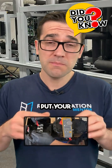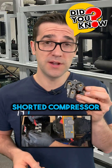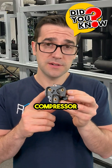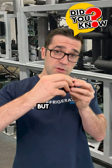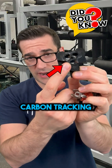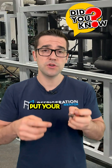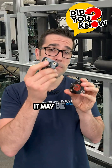Did you know that you could put your meter on a compressor with its insulator plate and it will read as a shorted compressor? Did you also know that maybe it is the insulator that has failed? This is a protector of the compressor — it separates the different leads coming from the Fusite. But behind here you could have carbon tracking, you could have a crack, or even moisture that causes this to short out. So when you put your meter on here with the insulator and it says it's a dead short, it may be this.